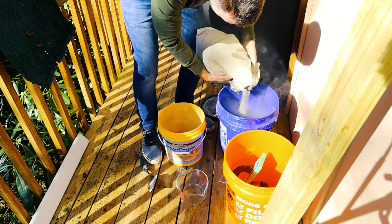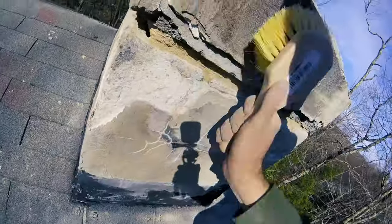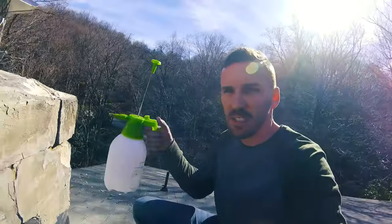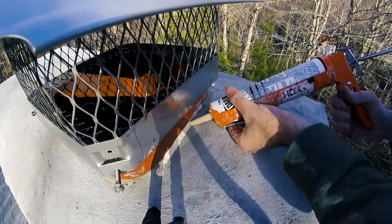For this project, you'll need the vinyl mortar, a wire brush, a soft brush, a pointing trowel, a flat trowel, a float, a spray bottle, and some high temperature caulk. I have all of these listed down in the description below with links.